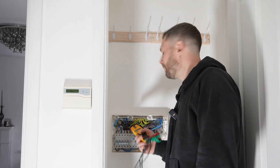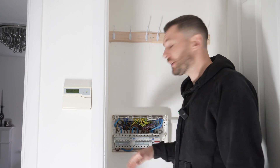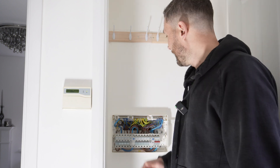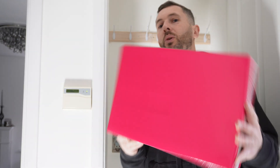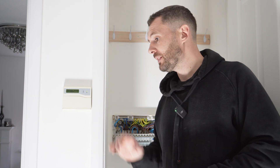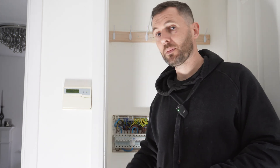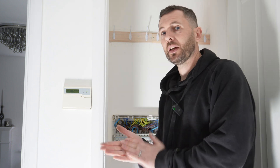What I've done is labelled up with a Sharpie all my circuit numbers, labelled one to match what the original is. I'm going to get that stripped out, get it all gone and get the new board fitted. We're going to have a fuse box going in with an SPD. It's metal clad now going in. This board is maxed out at 10 way and the new one going in is 14 way, so there's room for growth. There was talk of an EV charger potentially for new people who move in, with a detached garage which you'll see later in the video.